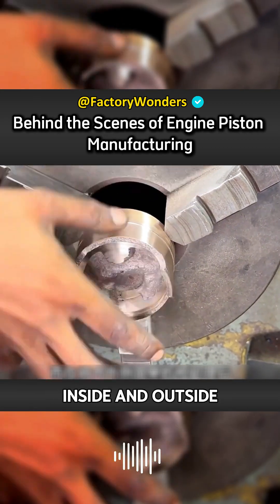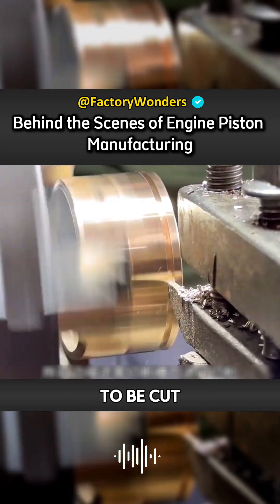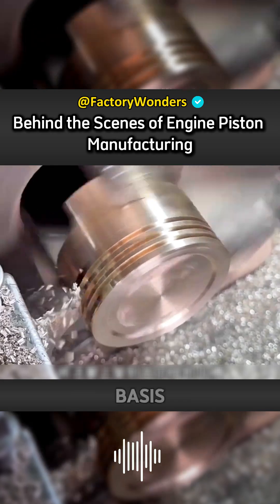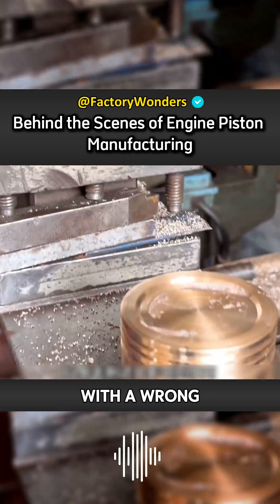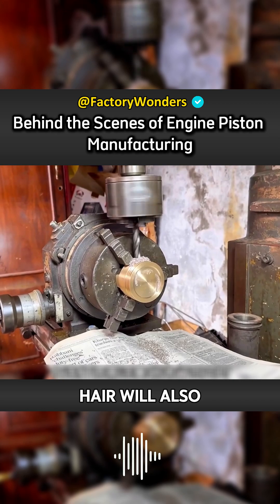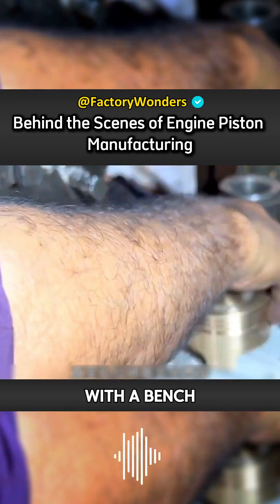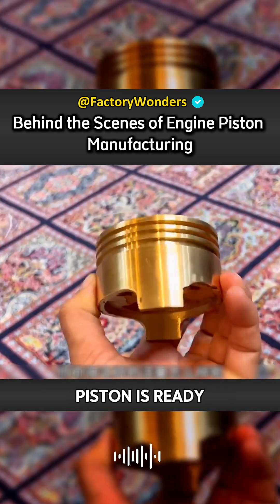After a simple pre-treatment of the inside and outside, the piston ring needs to be installed on the piston. The edge needs to be cut with a groove cutter. The original piston ring is used as the processing basis, and the same groove is cut into the piston. Then the burrs are removed with a file, as any burrs will also affect use. When the connecting rod needs to be fixed with a piston pin, the side needs to be drilled with a bench drill until the whole position is completely penetrated. So the copper piston is ready.